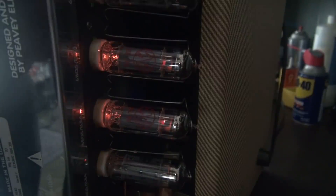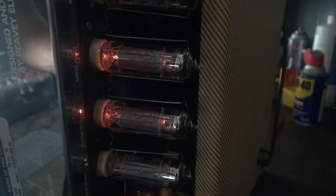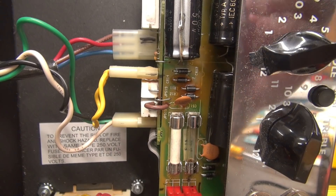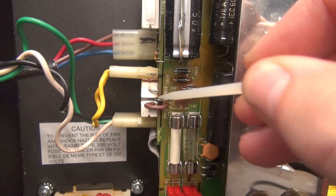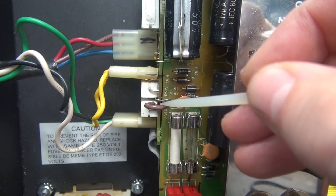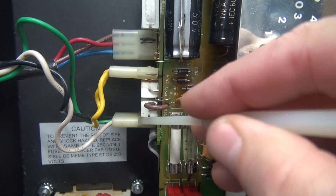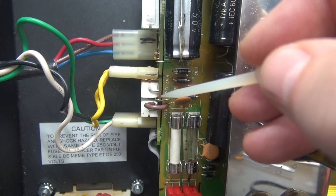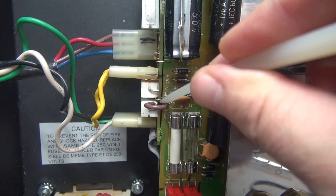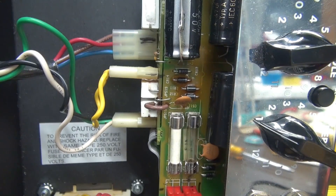It's going to play games with me. I'm pretty sure I had the area — when I opened it up and touched those wires, I interrupted it. So let's get in here and buzz it out with a meter and see if we can spot it. I was really hoping to catch that on video so you guys could see it come to life, but that's the way my luck usually runs. What I see here is this wire right there appears to be slightly loose — a jumper wire that had been installed in the past because one of these broke. We have the wire-wound resistors here and the plugs for the filament power. I'm going to have to inspect these connections and see if I can spot a crack. The first one I suspect is this guy — it appears to be loose. See how easily it moves in that connection? Let me get a meter on here and see if we can catch that.